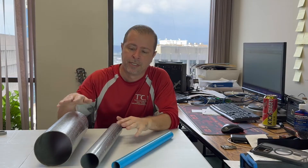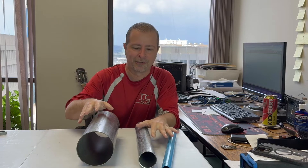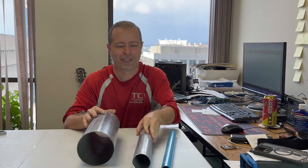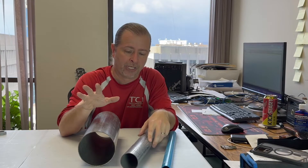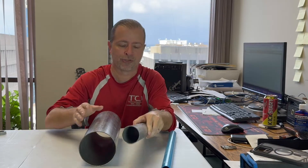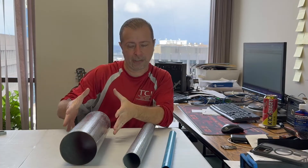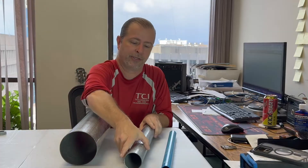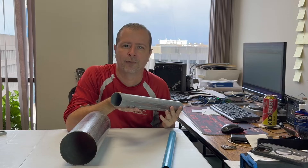In order to build chase pipes, I build them myself out of EMT — this is EMT right here. I'm going to try to do this video in a single take, so just ignore my slip-ups. EMT is something you can buy directly from Home Depot, Lowe's, etc., and you can get them up to a certain diameter at your local hardware store. For larger diameters you may have to go to ProSource, Grainger, or Graybar, or your local commercial building supply store. These are just metal tubes usually intended for installing high voltage, but they work great for cat6 as well.